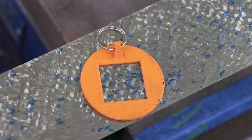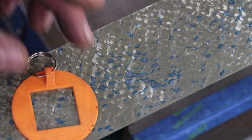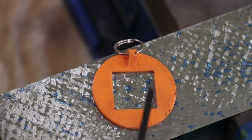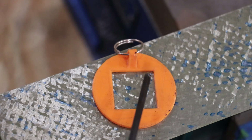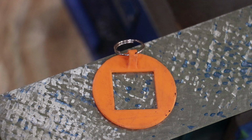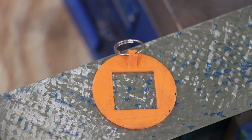That's pretty good, but it's not that all the way across. So we come over here and pick a random spot. Let me move you over. On this one, I'm getting 1, 2, 3, 4, 5, 6, 7, 8, 9, 10, 11, about 12. I have gone across my straight edge and done this in multiple places, and I'm averaging somewhere between 12 and 15, I would say. I've got some areas where I got 20, and some areas where I may be a little below 12. But I'm guessing 12 to 15 points per inch is about the average across here.